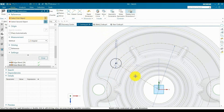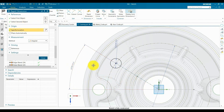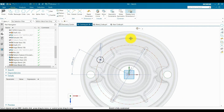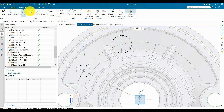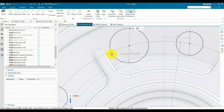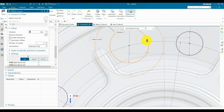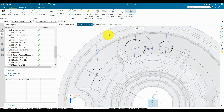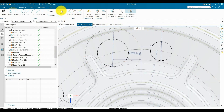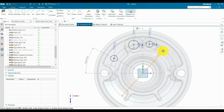We are planning to provide an ejector pin of diameter 8, so we create a boss size of 9. We are going to create a reference line so we can provide an angle to define the position — for example, here we are going to provide an angle of 30 degrees from center. Now we are going to create a sketch for our year code, using diameter 13 for the boss size and the ejector pin boss size diameter 9. We need to check there is no weak section formed in the die — this rib is cut in the die, so we need at least 5mm of material between the year code through-hole and this rib cutout. The ejector pin also creates a through-hole in the die, so we need to also check the material for the ejector pin.